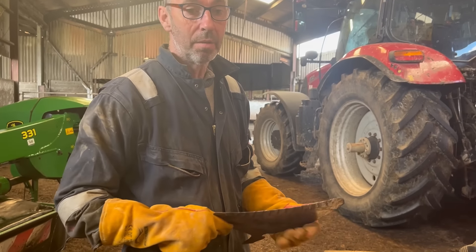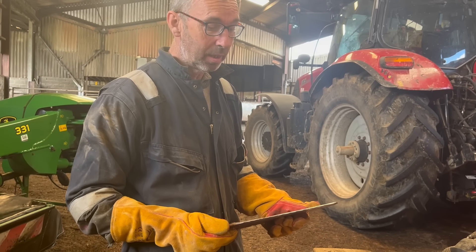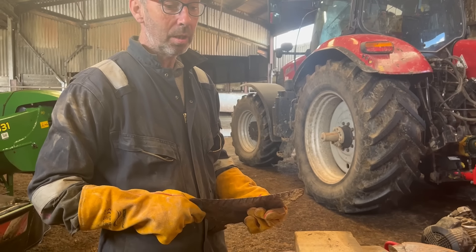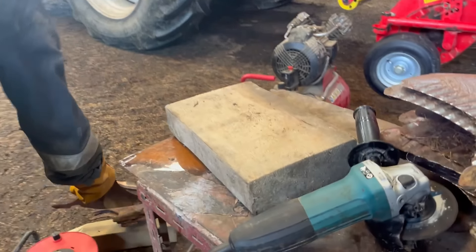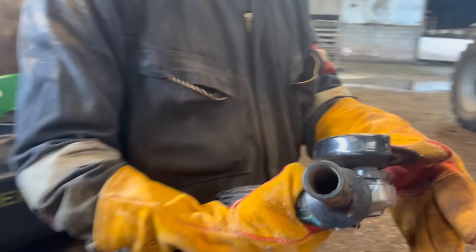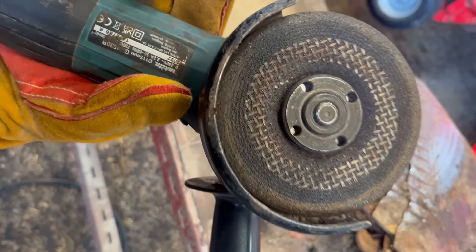You can see now that's got a nice sharp edge. That's quite a badly worn blade, but that will do absolutely fine. It's quite worn, so it's perhaps one I won't put back in, but it's always nice to have a sharpened blade - so if you do put it back in, you know it's sharp. Sometimes you can have a stony field - if you're freshly reseeded you might break three or four blades and you haven't got any new ones. So it's always better to shove a few old ones in and keep the new ones for the better ground. So you just use a little handheld grinder there - just a normal little grinder with a stone disc for sharpening metal.